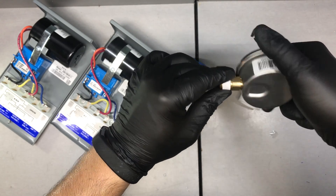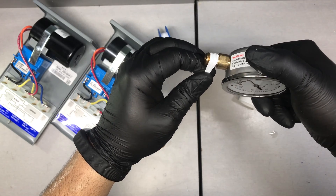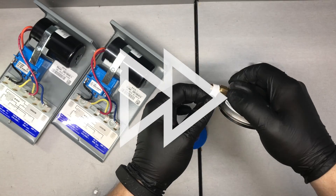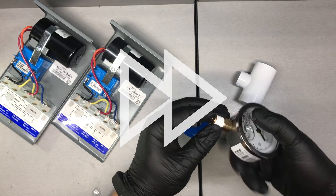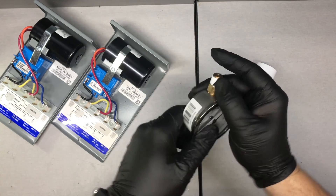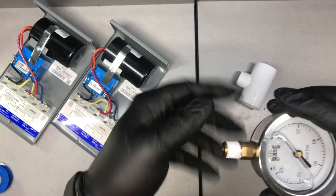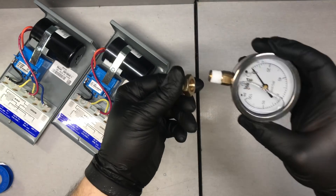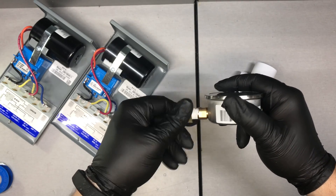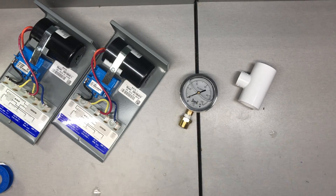You want to wrap it about three or four times. The trick is to get this to roll on nice and flat so it doesn't buckle up on you. When you cut it, do a nice pull and then twist it back. This is going to be your threaded end, and this is going to go into here like this. When you start it off, kind of back it off a little bit — it'll hook and then thread it on. This is the kind of stuff you don't want to rush. It looks simple but you can create a lot of headaches when you cross-thread something and have to go back to the plumbing store.